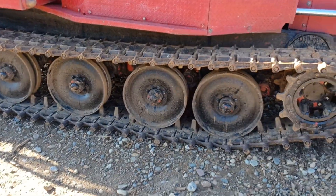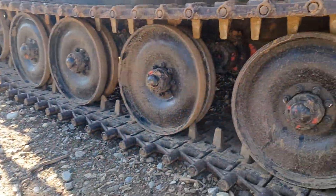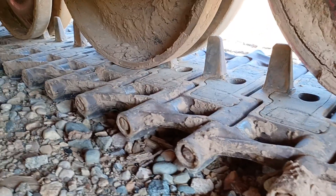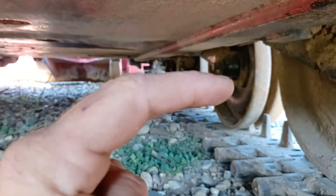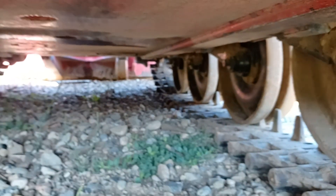Why is this called a soft track? It's because each one of these wheels is on its own independent suspension. All right — guys asked about the soft track. Believe me, ain't nothing soft about that. You know how many clipboards, thermoses, electronics, phones I've crushed. Each one of these is its own swing arm — each wheel can come up individually eight inches. That's why they call it soft track, as compared to a dozer, which is just one hard plate all the way across.